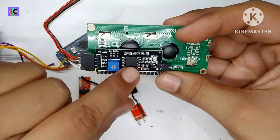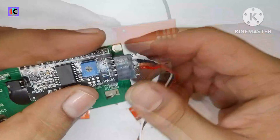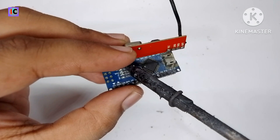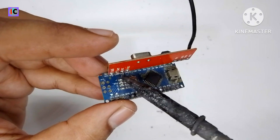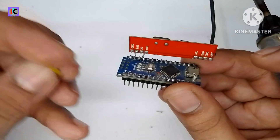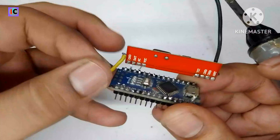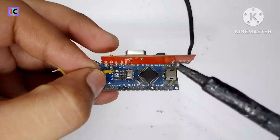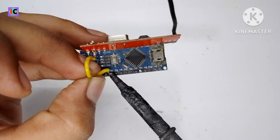For the data display I am using an I2C display, and you can see this uses just four wires to display the data on the LCD. For the connection we have to connect the RF modules to the Arduino Nano. The 5V connects to 5V and ground of both modules will be common, and the data output pin of the 433 MHz module connects to Arduino Nano digital pin number two, as configured in the code.